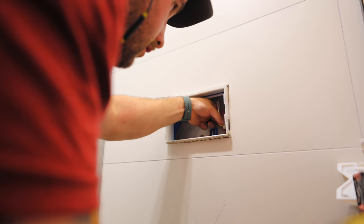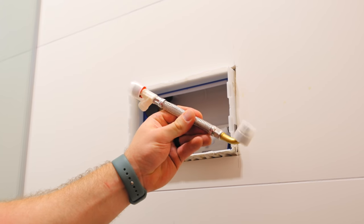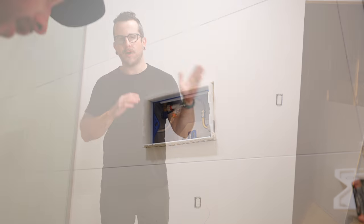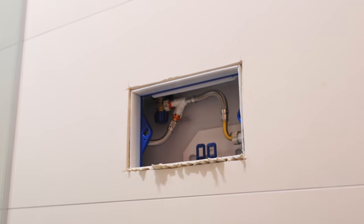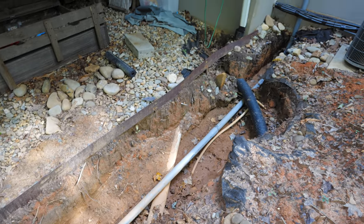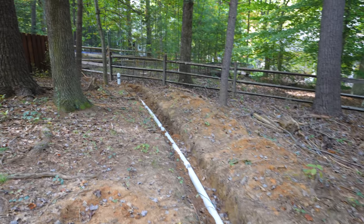Since the toilet tank is hidden in the wall, the area where the actuator plate will be installed functions as the access panel to all the plumbing. I needed to get an extra part connected to route the water supply — controlled by the blue knob in the top left corner — to both the bidet seat and the tank itself. Once those connections were made, I could also break away the excess material from the rough-in box, which can be broken to match your wall thickness. I ran outside to turn on the water, which was hooked up a week or so ago along with the sewer line, and both of those inspections passed.